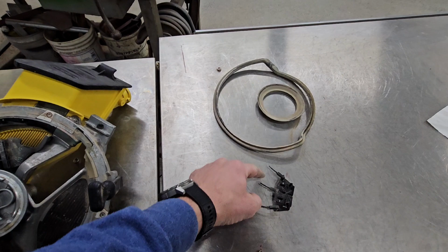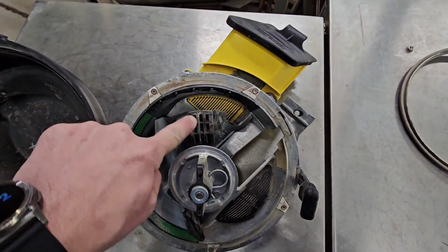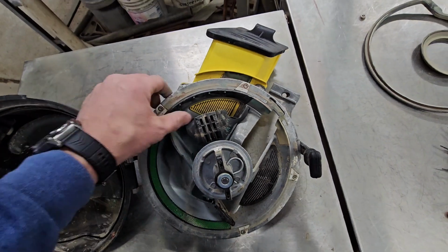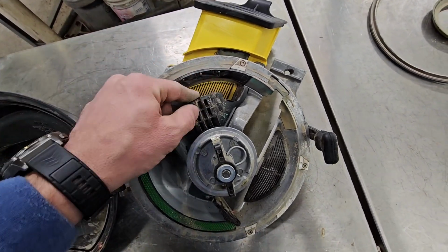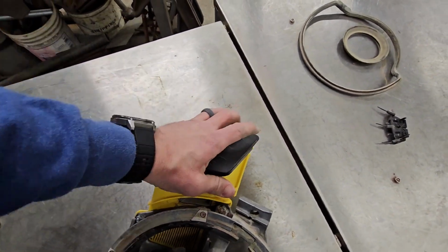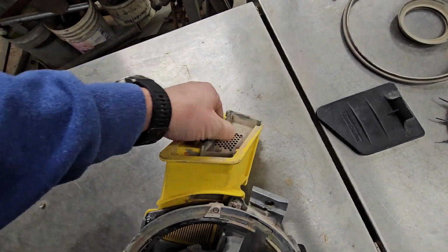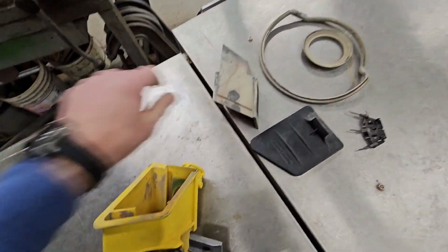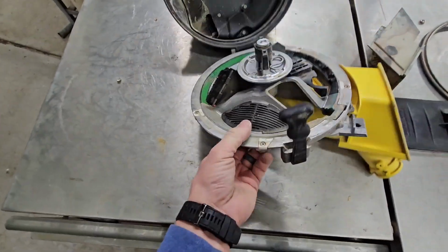These little fingers here, those are the ones that eliminate the doubles from the seed discs. We need to clean all of that stuff up. We're gonna inspect the outer double eliminator on the outside edge here. That looks okay. We'll pull this lid off. And we're gonna pull this piece out. That needs cleaned. And we're gonna wash everything else down inside there.